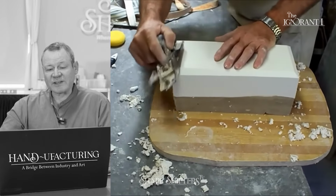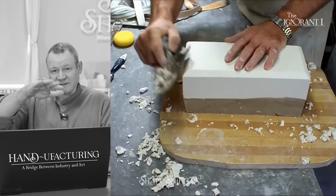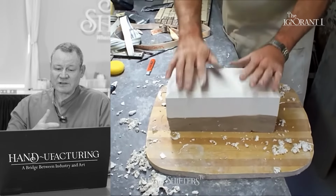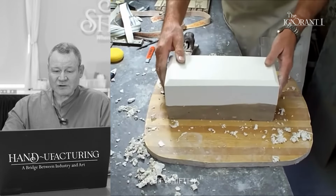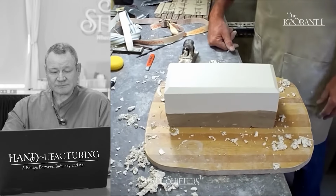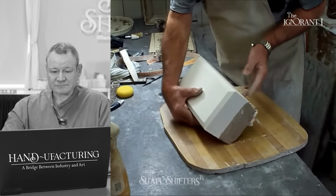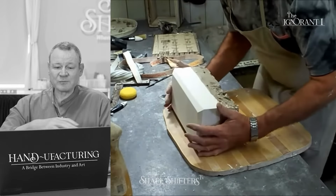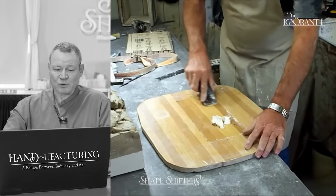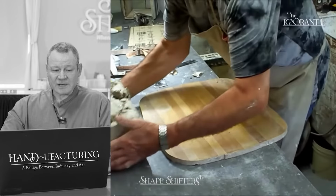So, from first take, it doesn't look like the mold wall was very good. You know, in my mind it was like this, but because he does the cleanup and the surfacing afterwards, you know, it's easier to straighten out plaster than it is to straighten out clay. I used to put my clay, I would always put a piece of wax paper down just to help it come off of the board. You wouldn't think it's a big deal, but it can help.